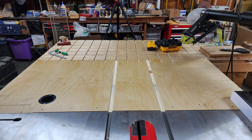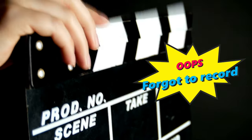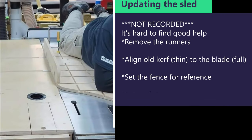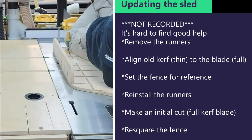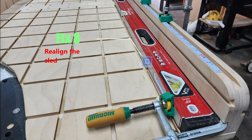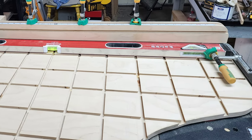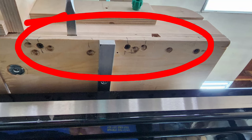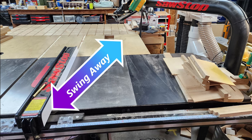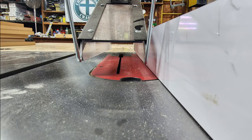And now I can access the micro-jig clamps from the back side. In typical Chris fashion, I thought I hit record but I clearly hit something else and didn't get any footage of me actually adjusting the sled. So here's a rundown - sort of an overview. I did use a straight edge because the fence did want to bow when I released all the screws. I used the micro-jig clamps to keep everything clamped down, used the original kerf line which was thin kerf, lined it up with my new full kerf blade, and then adjusted the fence before reinstalling the runners. It was a lot of screwing around after that to get the fence re-square. I do love that overarm dust collection - you can push that thing away and swing it in when you need it. Works very well.